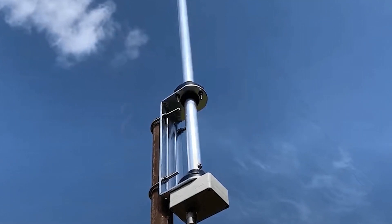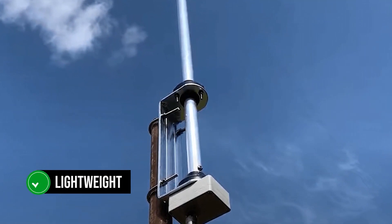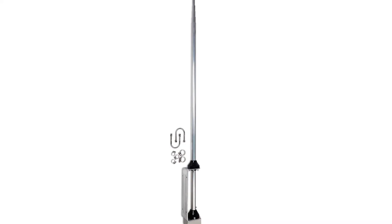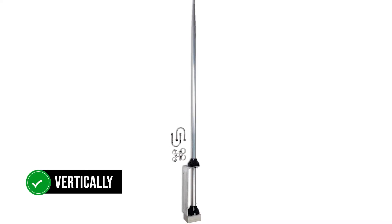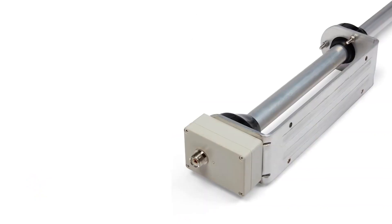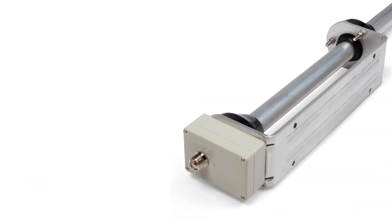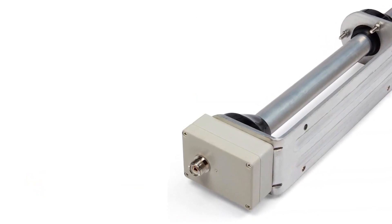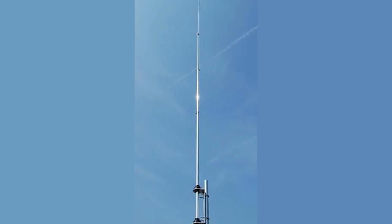The antenna is relatively lightweight and doesn't need too much space, which might make it a suitable option for many amateurs. It's placed vertically, so the space requirement isn't as extensive as some classic dipoles favored by hams. When installed, the antenna prefers to use the coaxial cable as the ground plane, which is also the preferred method. Otherwise, it tends to add some noise or show a noticeable drop in performance.